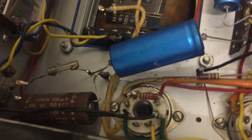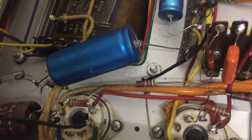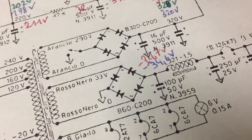I will solder most of the components in this power connection — not for the bias, but for the filaments. I can also measure these capacitors. This was a replacement capacitor installed somewhere else; I put it here. For the 100 microfarad I do have a replacement, but I have to test it out of circuit. Here's that capacitor in the schematic — this is the brown one. Let's test it. It drifted to 140. Let's replace it.